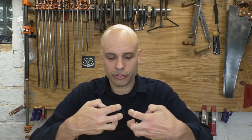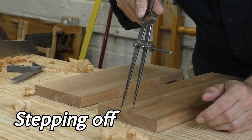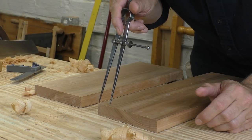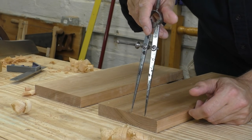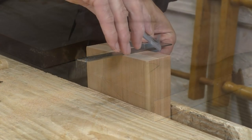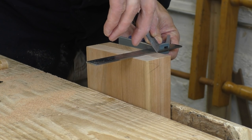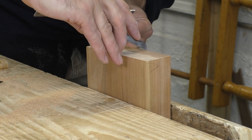This hinge is kind of like a box joint with five interlacing fingers, so I need to take those boards that I've prepared and divide them up really precisely into five equal sections. What tool should I use for that? I bet it's the one called dividers. Dividing up a given space is often called stepping off — there's a bit of trial and error involved. You tighten and loosen the adjuster until you can step off five divisions and have the tool's leg land exactly on the far edge. Then you step off one final time, pressing hard each time the tool touches the wood. Sharp dividers give you deep marks, and dropping the tip of your knife into those marks lets you bring in your square and turn those divisions into clear layout lines across both pieces.